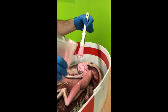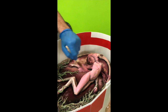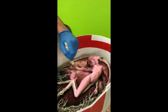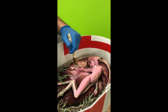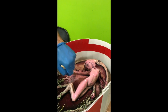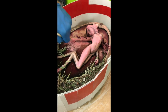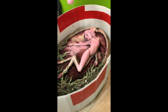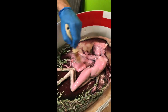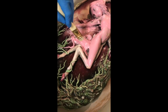This is what they might call a beauty coat. Try to get in there, get all that detail covered. That inner cut right there is going to be a bear — that's a good place for bubbles to go, a good place for air to get trapped. I put it all right here on the flat area so I'm not flooding the intricate parts.